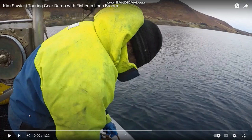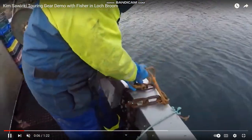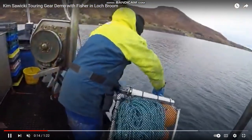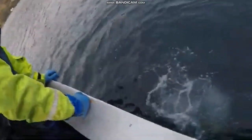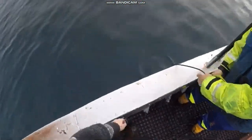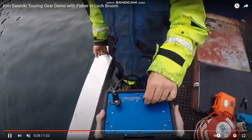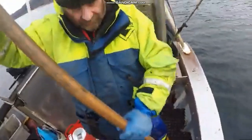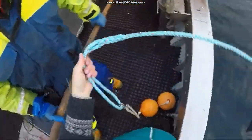I'll start with the coastal system. This video is by Kim Savicki, done in Scotland at Loch Broom. Here you can see an anchor going over the side, and then the release bag with the acoustic release — the white thing on the side — now submerged. The over-the-side transducer is going in, and somebody is flipping the switch on, which initiates the broadcast release. You can just leave the switch on the whole time. The buoy pops up — obviously this one is edited for brevity.